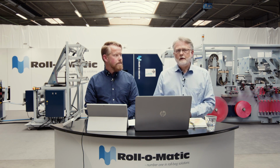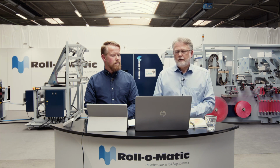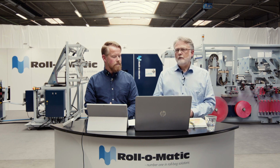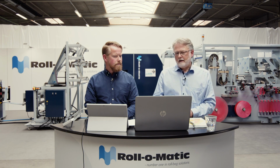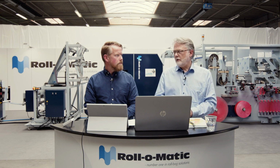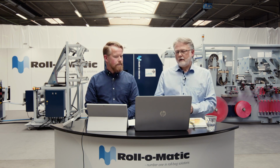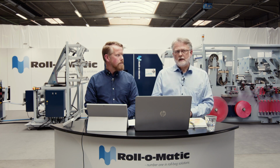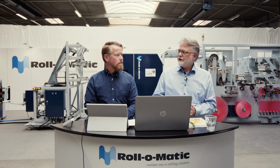Our draw tape module can run basically three different types of rolls. It can run pancake rolls, that is either the finished width of the draw tape or double width that would be C-folded afterwards, or it could run cross-spooled materials. The best one, in my opinion, is normally to run the double width, because you have twice the amount of material on one roll compared to just the width of the finished tape, and you also have a very good tension in the side of the draw tape at all times, where the cross spool sometimes could have a little bit of variation in tension when it actually changes direction.